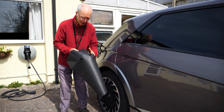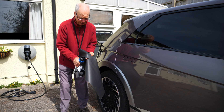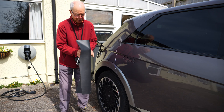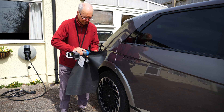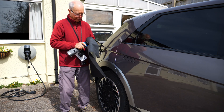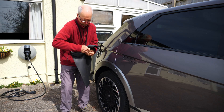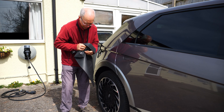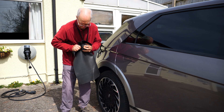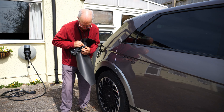You can see that I've made a hole and the hole is a lot smaller than the plug. I'll give you the measurements in a moment. We want to fit the plug into this hole — we're really stretching the rubber tight. If you cut it the same size as the plug, it won't work because it won't form a seal.